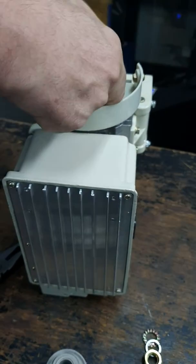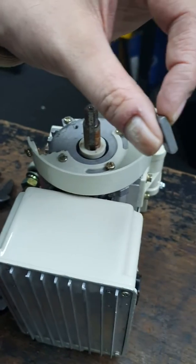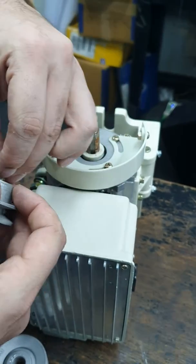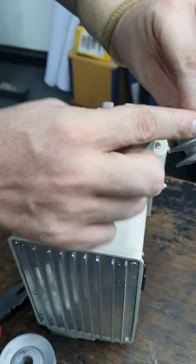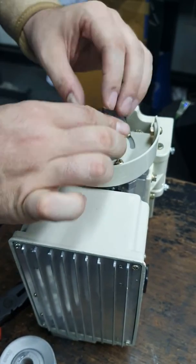What you'll find is there's a small rectangular piece that comes out. This is a cutout to make sure that the pulley doesn't slip around. So make sure that that goes back into your new extra small pulley and then into this gully here. The long section goes down first into the motor like so.